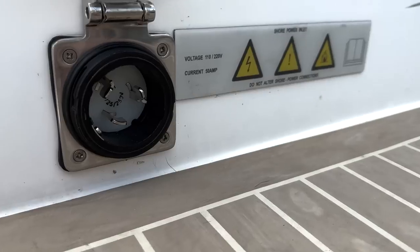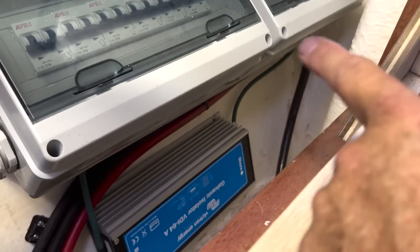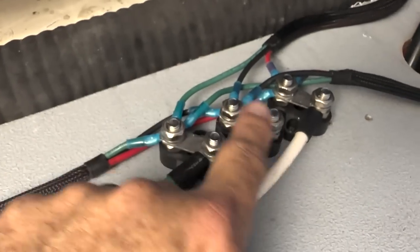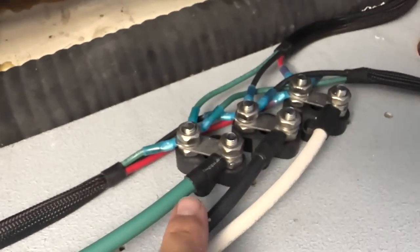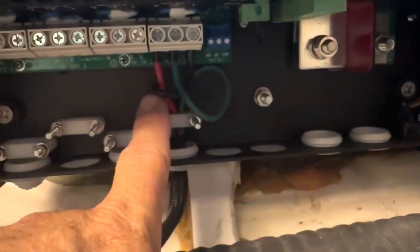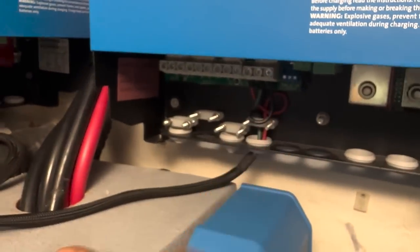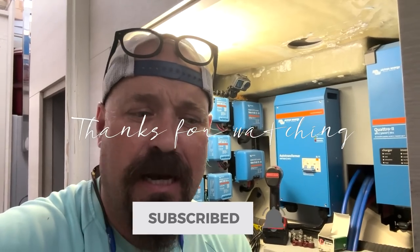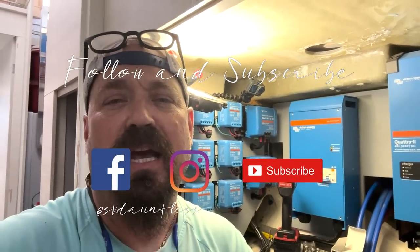It is more than a little toasty and I think I'm now reaching a stopping point for the day. I've got everything from the outlet in the back of the boat through the breaker, down to the galvanic isolator, up to the bus bars. I've got ground, hot, and hot with the corresponding colors — white is ending up being red — and every single one of these wires is in a loom that runs to AC one input on all three of the inverters. So now they've all got AC running to the inverters. I'll be jumping on the DC side next week. If you liked this video and you enjoy what we're doing here on this nerdy electrical, please hit the like button. If you're not already subscribed, please consider doing that as well. Until next week, I hope you guys have a great weekend — thanks again for watching, and I'll see you guys next Sunday.